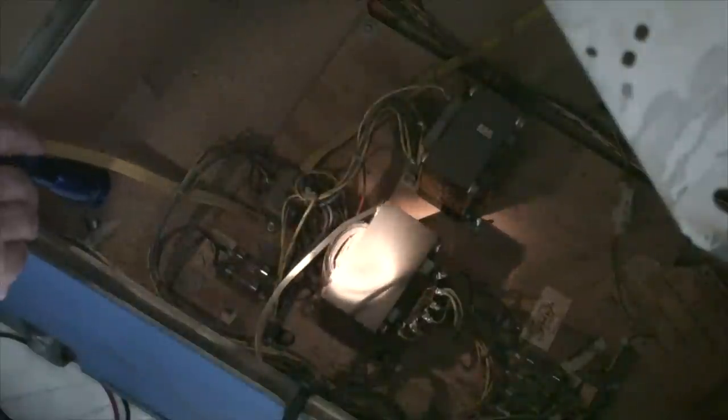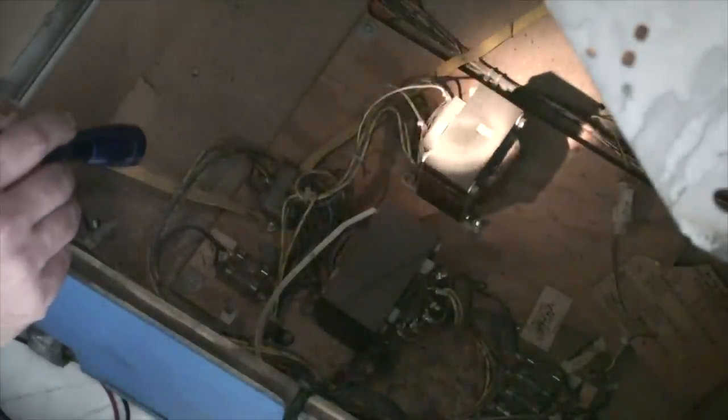Now, basically, what we're looking at right here, power supplies are not the same, but you're going to see common things. This is the main fuses coming from the wall. So this is a main thing coming from the wall. This little guy right here that you see me shine the light on is a filter. This is just to help keep the signals from messing up things. Then it goes into our main power transformer. And over here is a transformer for our monitor. So this is where you'd be looking if you're having monitor power problems.